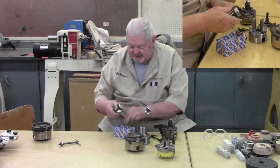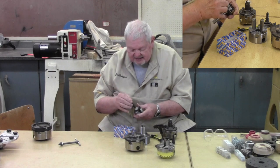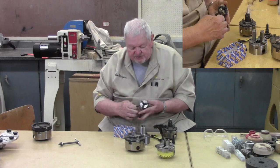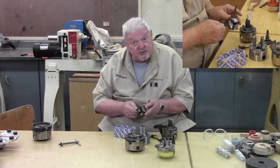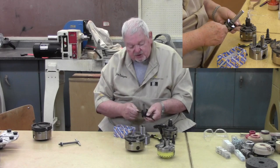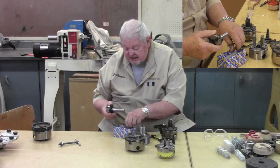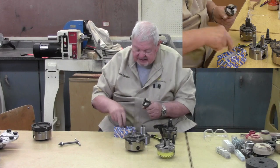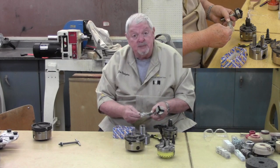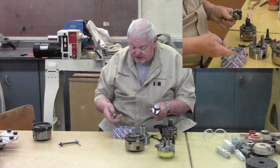Here's something interesting — this is a three-jaw chuck that operates with levers, as most four-jaw chucks used to in the old days. It has a number-two Morse taper on the other side, so this will fit into the headstock to hold very small projects. It also comes with a shaft that can be replaced if it's a Morse taper-one lathe — not too many of those around anymore, but there still are some.